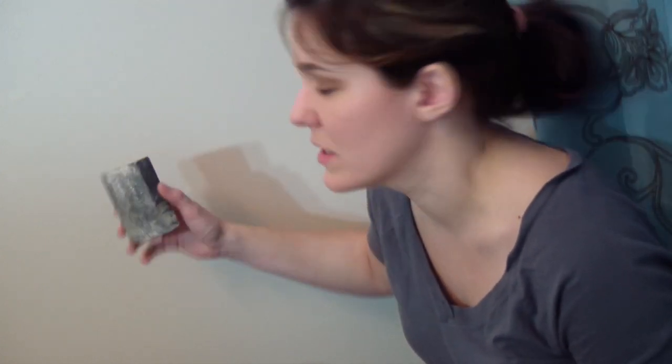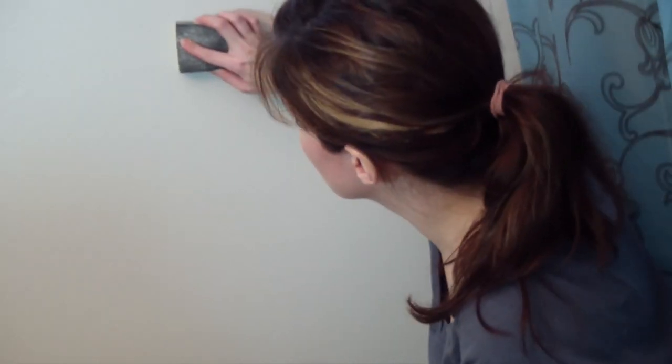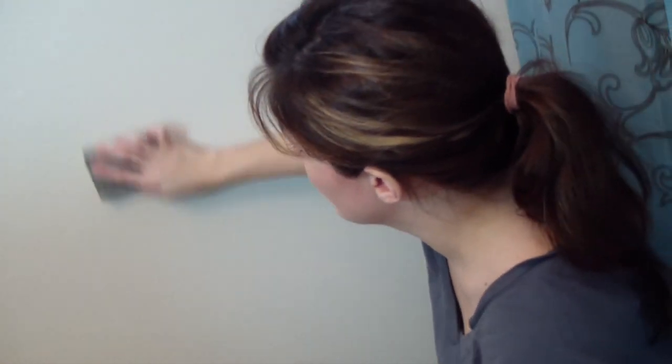Back in the bathroom, the first and probably most important step is getting a smooth even finish for your batten board base — your wall. We're not actually going to use a particle board behind; this is the easiest and quickest way that also looks nice. Take a drywall sanding block or sandpaper and if you notice any uneven surfaces in your paint — bubbles, fuzz, or hair painted in — sand the surface below where your batten board is going to be. Smooth out any imperfections so you have an even surface to paint, then dust off any residue from sanding.